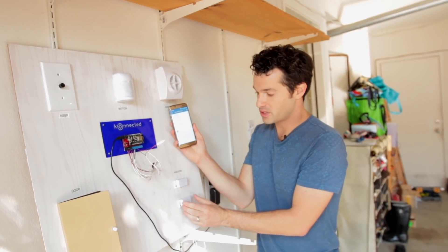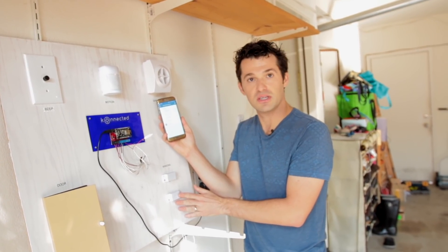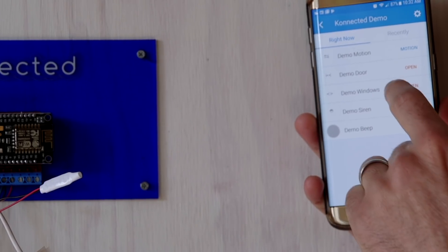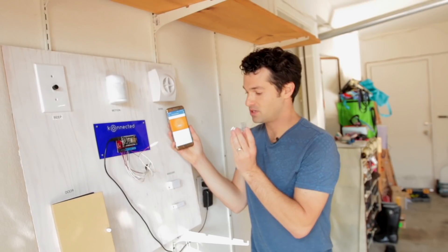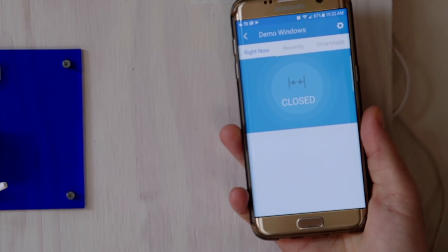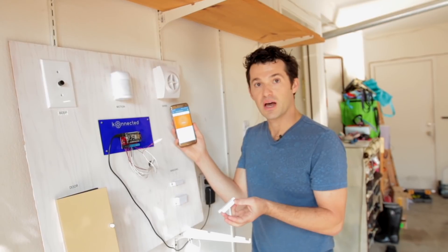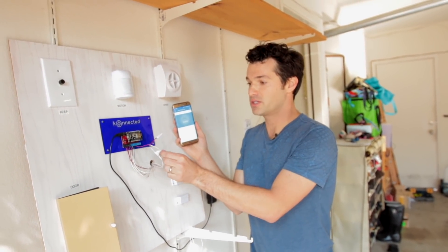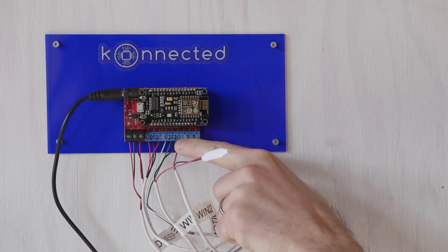When windows are tied together in zones, these are the typical magnetic window sensors you see very commonly on all your windows. If either one of the windows is opened, you'll see the demo window show as open. I've just opened one of those two windows — I'll put it back and it'll show as closed. If I open the other one it'll also show as open. This is how we can combine multiple sensors together in zones, with the other terminal end connected to ground.